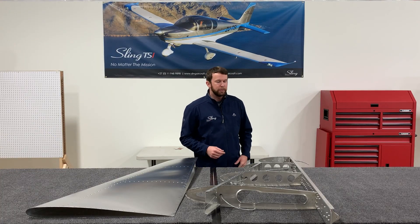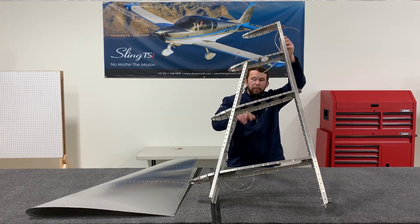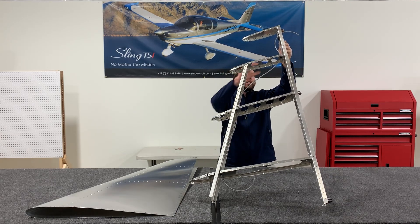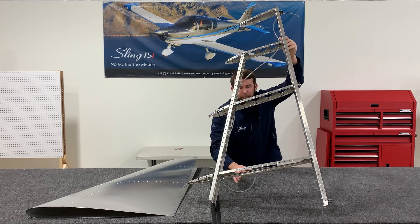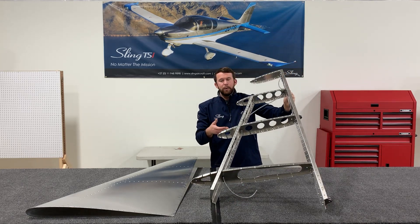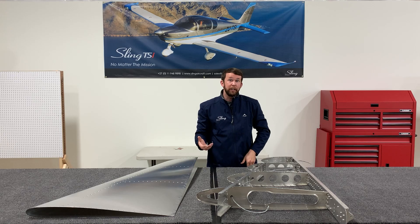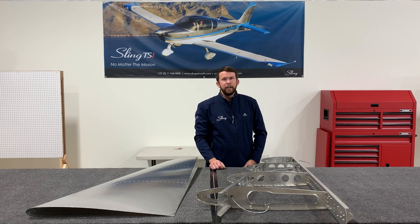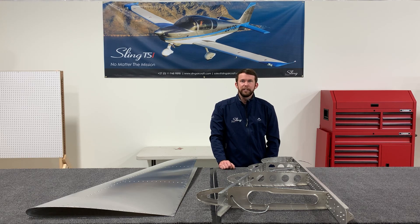The very top hole uses edge protector where the wire exits through the rib hole. Now that we've got the wire run through the vertical stabilizer, it's just a matter of installing your grommets in the holes and using a little bit of soapy water to help lubricate the wire through those grommets. Make sure to leave enough length on each end of the wire to install your connectors. Also, at the bottom of the assembly, leave enough wire to allow nesting after final assembly so the wires don't interfere with your elevator counterweight. Leaving too much wire is always better than not enough.